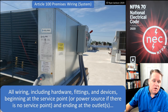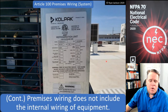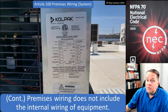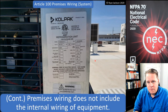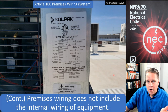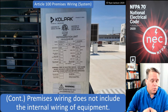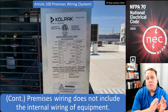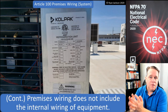The outlet is where it connects to the equipment, and that's where the premises wiring ends. Premises wiring does not include the interior wiring of the equipment. All of that stuff inside is just part of the equipment because it's downstream of the outlet — therefore it cannot be part of the premises wiring system. This wiring inside is not part of the branch circuit because the branch circuit ends at the outlet. The outlet is one of the most fundamental and most critical definitions in the entire codebook. The outlet is where the premises wiring ends; the service point or other power source is where the premises wiring system begins.